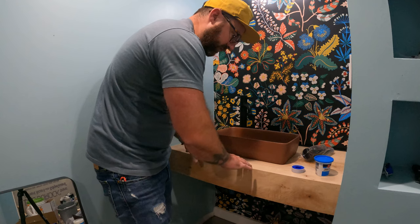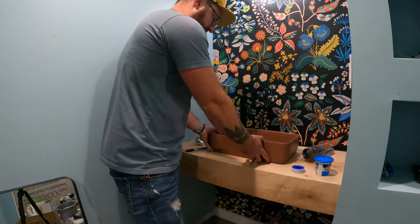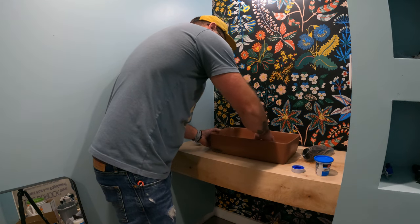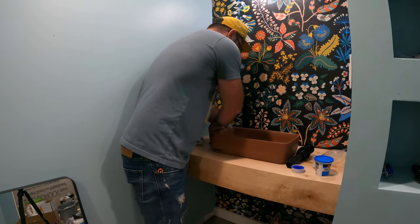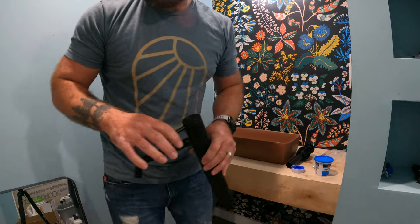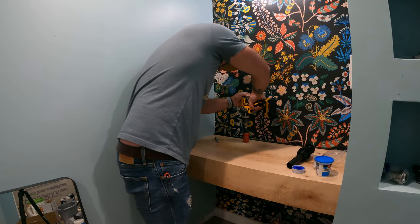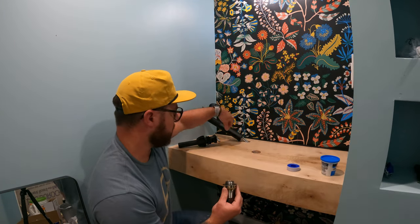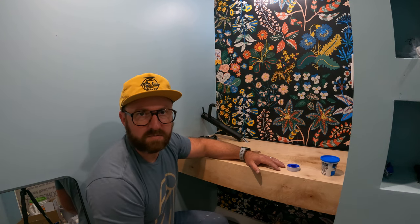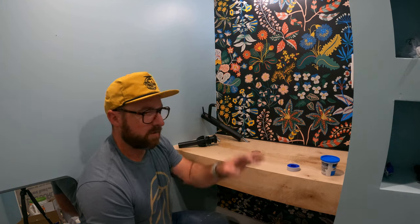Now it's time to install the sink as well as the faucet. These are just placed here — I haven't installed them yet. Basically what I did is measure for the center of the countertop, and I wanted the sink a little bit farther towards the front, but you can place it wherever you want. I'm going to grab a Sharpie and mark the hole in the bottom of the sink and trace where I want it installed. Once I have both holes traced out, I'm going to remove everything. Now that I have both hole locations traced out, I'm going to use my hole saw. Now that I've drilled both holes, I'm going to install the sink and the faucet per the installation guide that came with the kit. I'll link the kit in the description below — it has great reviews and it's a pretty awesome kit.